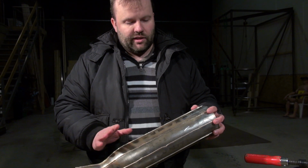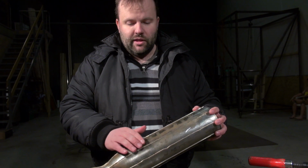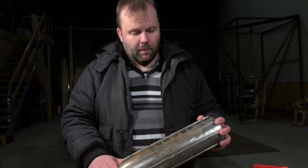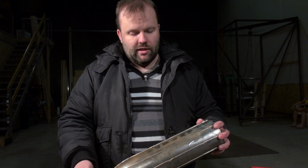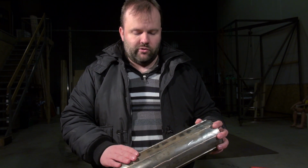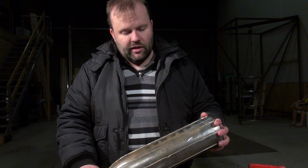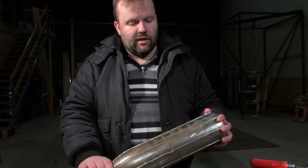And from the cleaning up process, it has been possible to determine that the primary goal of very high heat conduction is definitely achieved. This means that the heat from the combustion inside the inner liner will be transferred through this inner liner to the surface, where a lot of fuel will flow very fast along these cavities and remove the heat from the surface of the inner liner.